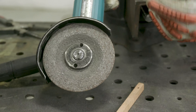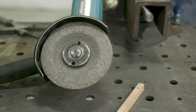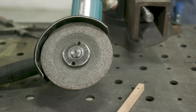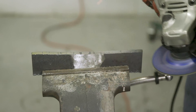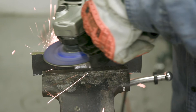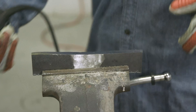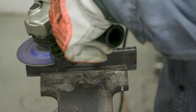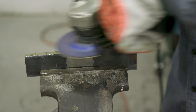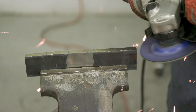I still have a lot of life left in this wheel after taking off two backing strips and two welds. I'm going to flip the pieces on edge and clean up the sides. With the edges, I just want to take this down and make it nice and flat. I don't want to take too much material out because I still need to maintain that inch-and-a-half width. Right now I'm just going to cut off the cutting marks and smooth this out - as long as it's an inch and a half wide and all imperfections are removed, we should be good.